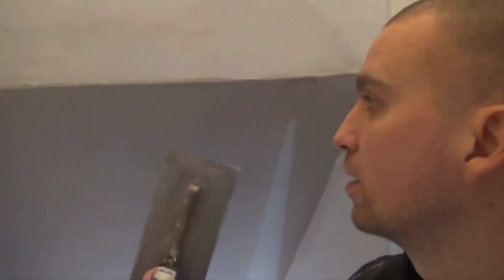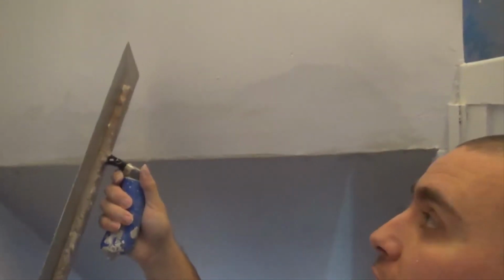That's that tidied up there, guys, and trowel that right the way down to the bead. Still a couple of wee snatters on it there, but you can see how tidy it's come up. We're getting close here at the minute, but I'll bring us right in close. Obviously you're still at the mercy of whatever shape that wall is to follow, but to me this is a clean enough way to go. I still have another bit of tidying up to go yet, just make it look a bit sharper as it sets.